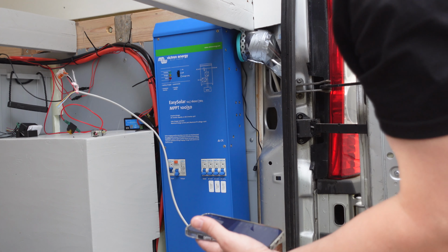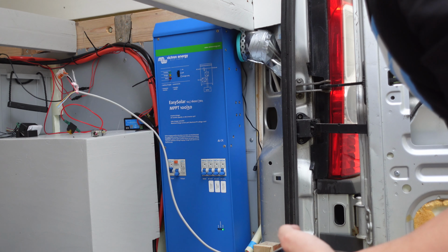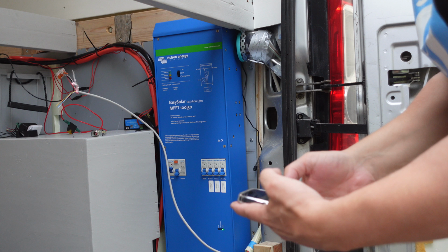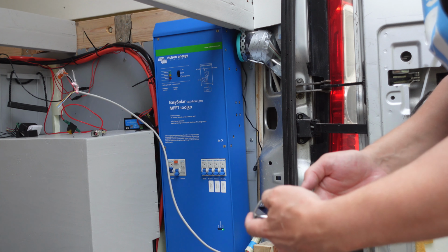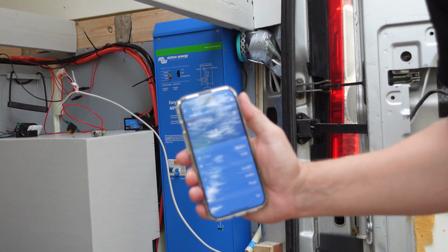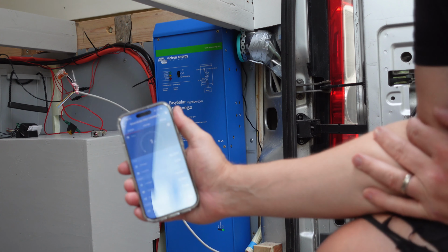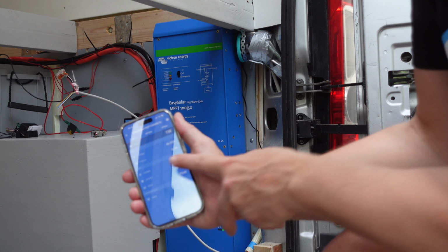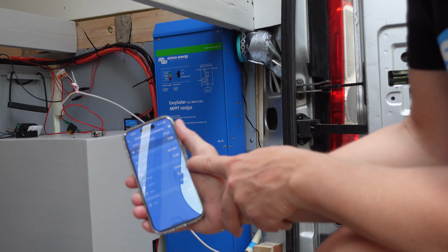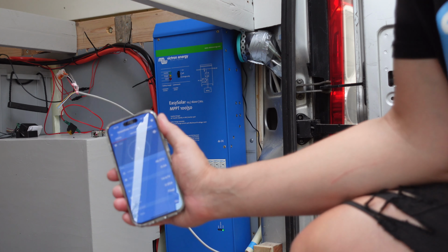And is it anything different now? I didn't do anything. It took just a little bit of time, but now it activated the charging. And let's see. The voltage is now stable, 14.8. And now it seems like the solar panel did drop to 1 watt, so we are not having anything coming in from the solar panel. But we still have the voltage over the normal voltage. So this is the charging voltage, and I would assume that it's now working.